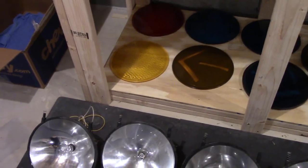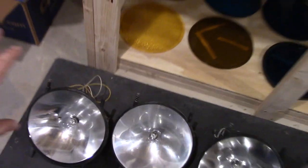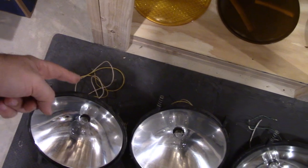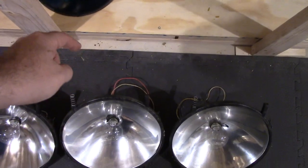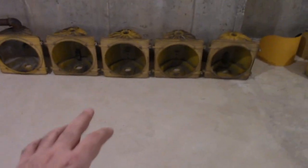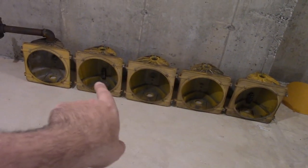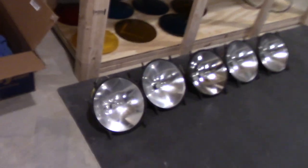This one wasn't color-coded quite as well compared to the other 8-inch light. You can see this is going in order from red to green, and then yellow-green arrow. But the red light had a yellow arrow, yellow's fine, green was green, that's fine. But the yellow arrow had a red wire, and the green arrow had a yellow wire. Now, it is possible that was because this is the same order. The yellow main and the green arrow have the terminal block. So maybe they did that just for color coding purposes, just so you know which was which. Maybe we'll figure that out when we can.